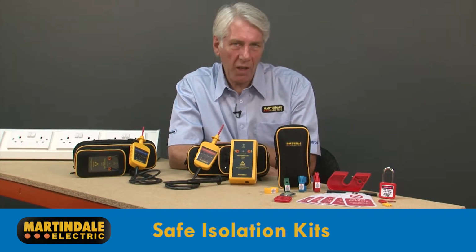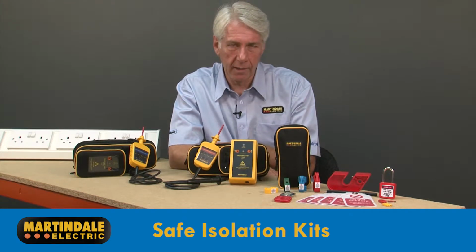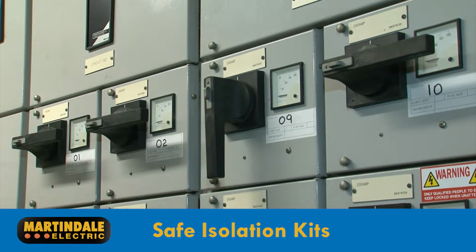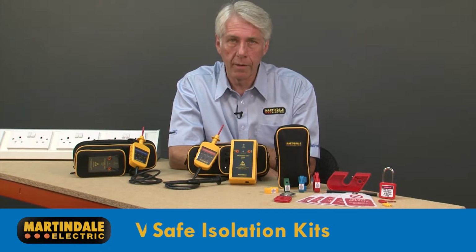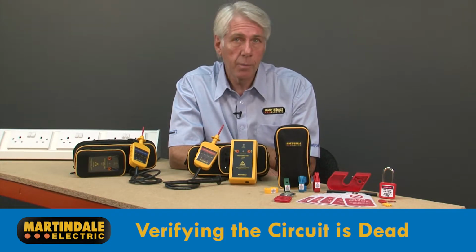No matter where you work, whether in a factory or someone's home, it is essential that you avoid working on or near live conductors. This is a requirement of the Electricity at Work Regulations, 1989. And it's much more than just about switching off. It's also about preventing the supply from being inadvertently reconnected by someone else, possibly with you on the other end. It's also about verifying that the circuit or equipment you're working on is actually dead before you start.